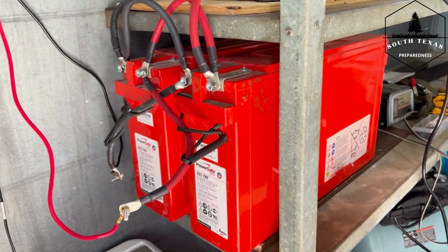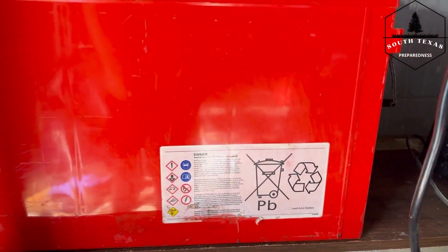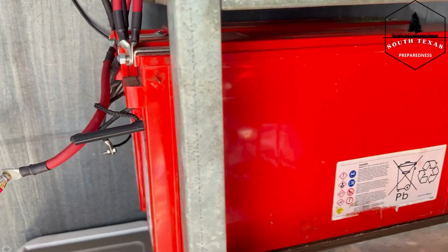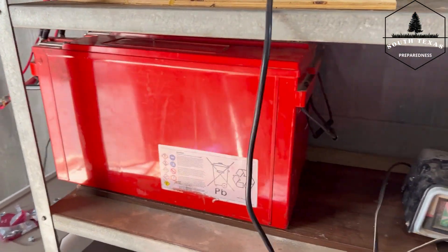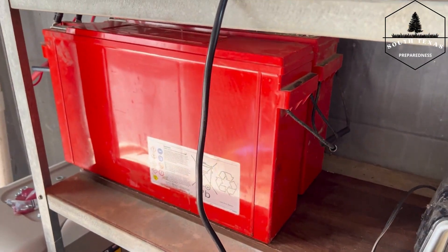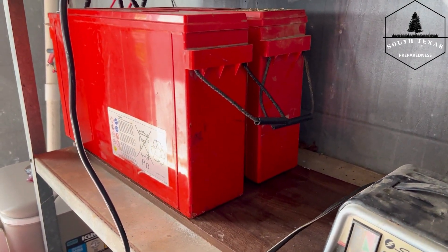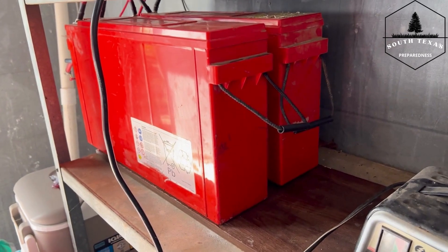Next are the batteries. I need to do a little better cable management, but I have them wired in parallel and they are lead acid batteries. These are used, which is where I came up with a lot of the cost savings. They're 190 amp hours each and around 130 pounds a piece — I bought them used off Facebook Marketplace and got a really good price. Definitely shop around. Eventually, as far as scaling, I'd like to continue getting these, or if I get a good deal on lithium batteries — which can drain a little further without damage, and have a longer life cycle — that's something I want to do.